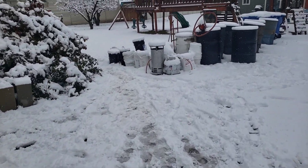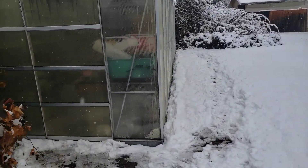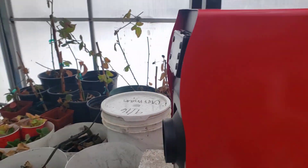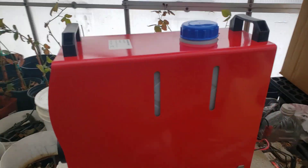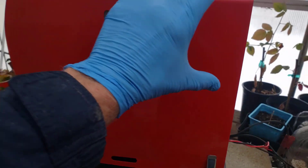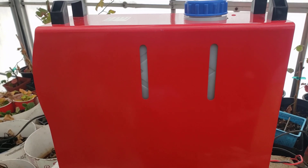So I discovered this little boat cabin diesel heater that draws 37 watts of power to run the fan on the burner. It's rated at five kilowatts — you'll see these on Amazon. I think we paid about a hundred dollars for this one. It runs on 12-volt battery or 12-volt power supply, and I filled it with brand new diesel to start.